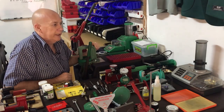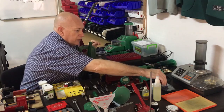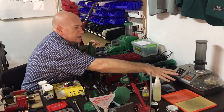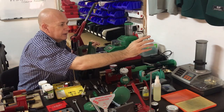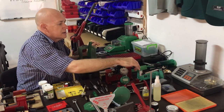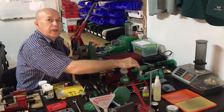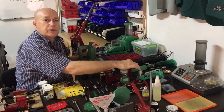There's something you most probably won't be able to get away without — something that can measure or weigh your powder — a scale. Here's a very small one if you want to quickly load one or two rounds. Here I've got a dispensing scale from Lyman, the DPS 1200, which I've used for many years with very good results. Then there are mechanical scales — this one is from RCBS. A mechanical scale is very accurate, and I'll show you how to calibrate it to measure not just by 0.1 grain but by 0.01 grain as well.